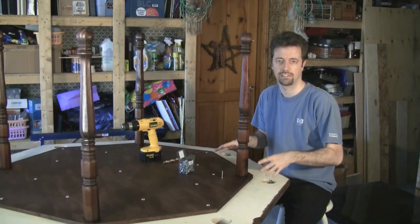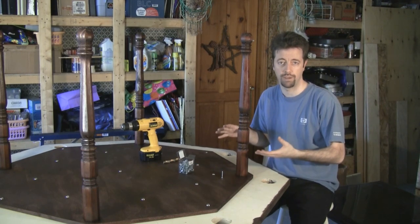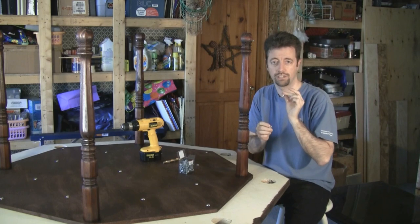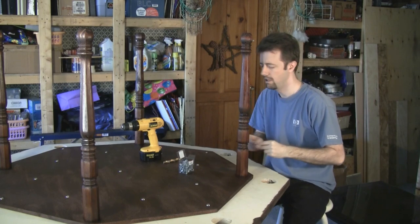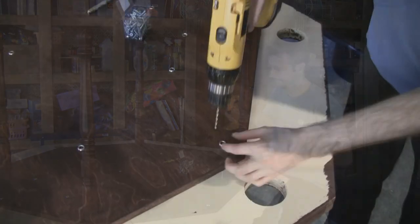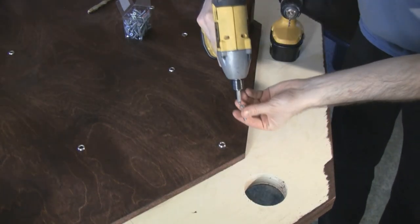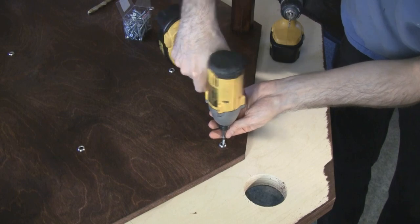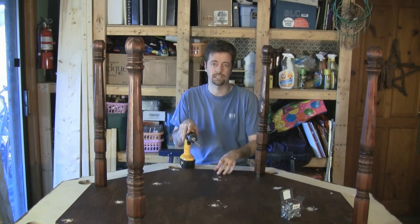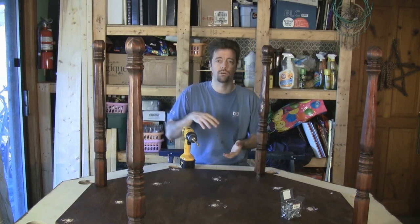In order to attach the base to the table, I'm going to use screws. I don't want to glue this so that I can take the two pieces apart if I ever want to move this table from house to house. I'm using number 10 wood screws along with small washers that will stop this from counter-sinking all the way into the plywood. I'm going to drill pilot holes everywhere I want to put a screw using a 9/64 drill bit. For our final bit of drilling, I'm going to put a half inch hole near the edge of the base — that'll give me a way of pushing up the MDF in the centerpiece without having to flip the whole table to drop it out.